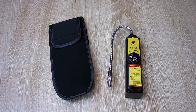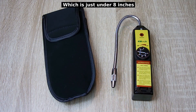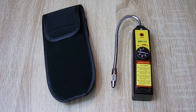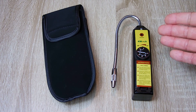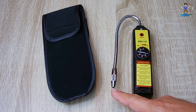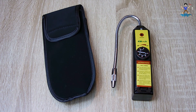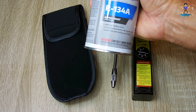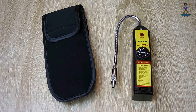You can expect a battery life of around 50 hours. Startup time is only 6 seconds, and response is instantaneous when refrigerant is detected. The probe length is 20 centimeters. According to the manufacturer, on the highest sensitivity setting of 7, the detector should achieve a sensitivity of around 6 grams per year — which is extremely little. If you look at this can of R134A, there's 340 grams in the can and it's only three-quarters of a pound, so a 6-gram-per-year leak is really not much.